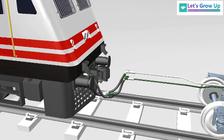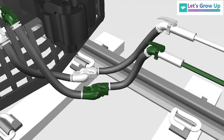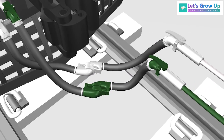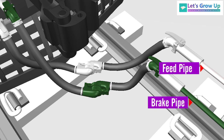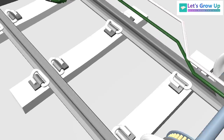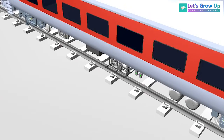As we know, compressed air brake system is used in a train. That's why air coupling hoses are used in between two coaches, for the continuation of airflow between the brake pipe as well as the feed pipe. These pipes are known as brake pipes (BP) and feed pipes (FP), which are installed on the underframe. The brake pipe and feed pipe run throughout the length of the coach.